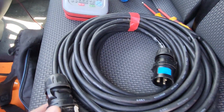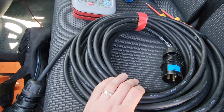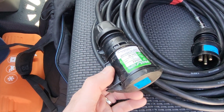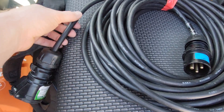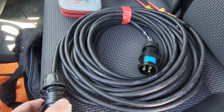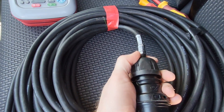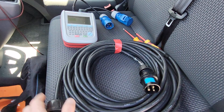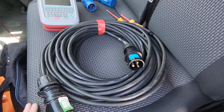And that is literally it. You'll have to get a bit creative with labelling these, because sometimes they're used in very harsh environments, outside and inside. I've got a label there which is heat-shrunk — standard pack labels, to be honest, don't really work. They'll stick on, get water on them, and come off straight away. You can buy proper tags, they're more expensive. I do a lot of event work and I tend to just test the cables against the asset number on the cable, and won't actually PAT label it, because as soon as you get a bit of rain in the field the label's going to come off. I hope that helps — if you have any questions, please let me know, and if you'd like to see any specific videos, give us a shout.